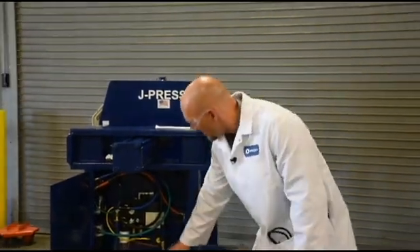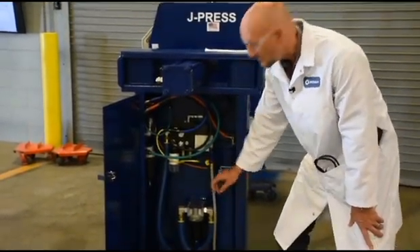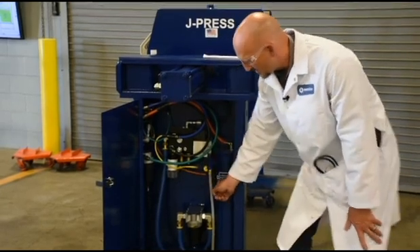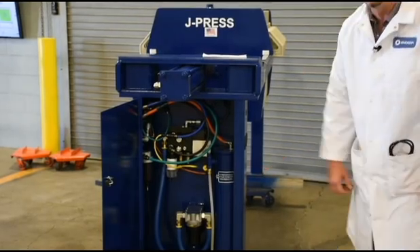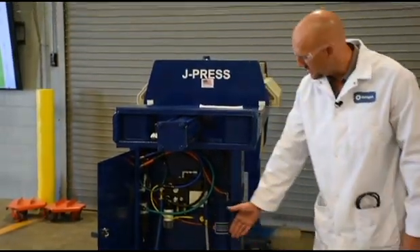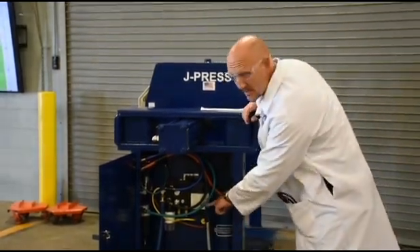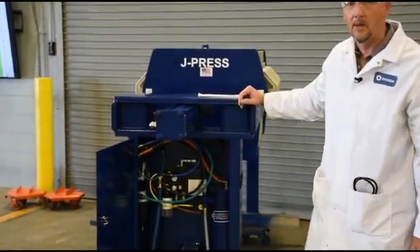Here's a little trick I'm going to let you guys in on. This is your sight tube right here that tells you how much oil you've got in this reservoir. If you loosen the top of this sight tube and put it down into a bucket, it will just gravity feed right into that bucket — all the oil out of the system. Once you're done and it's empty, hook that back up. At the top of that same fitting, there's a plug you open up to fill the oil back up. It's really that simple.